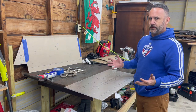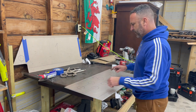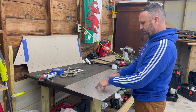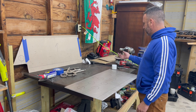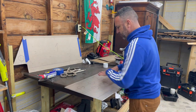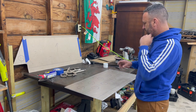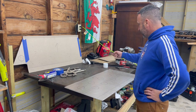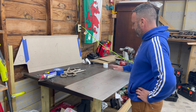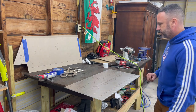I did all this off camera because you didn't really want to see me doing a bunch of weird math going back and forth between standard and metric. Basically I have the five holes punched in and spaced evenly out, then five speed holes or airflow holes across the top and the four lower ones as well. The next step while waiting on the drill to charge is to draw a fold line across this — what we're looking at right now is the inside. I may try to use what battery I have left to get these drilled while it's flat, then score the bend lines and head over to my buddy's house to get it welded up.